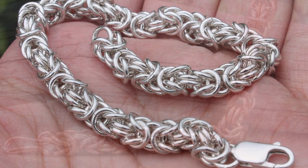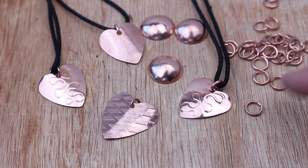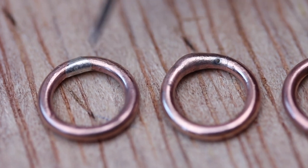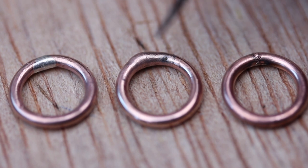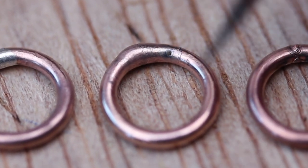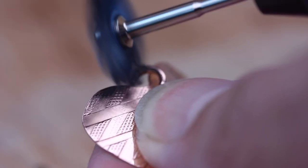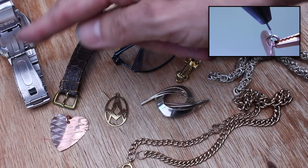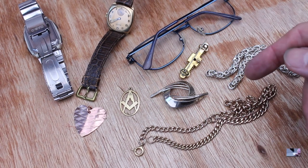So far I've been showing you silver and gold, but recently due to the price of precious metals people are starting to make jewelry out of other metals like copper, brass and stainless steel. I recently came across a problem with some copper hearts I made — I wanted to solder little jump rings closed at the top, but what do I solder copper with? Some people just use silver solder but it does leave a bright silver line so it looks a bit ugly. I did buy some copper solder wire but because it has other metals mixed in to reduce the melting point you never quite get that precise copper colour match. But with the welder we don't need any solder — quick and simple, joins copper to copper. A quick buzz with a polishing burr and the joint is totally invisible. Likewise costume jewellery, copper jewellery, glasses, watches, stainless steel, brass — most metals can be welded without the need for any special solders or chemicals.